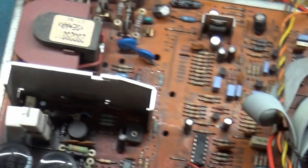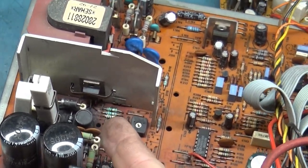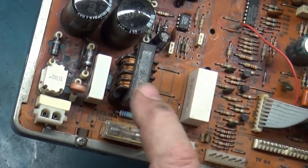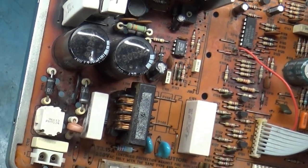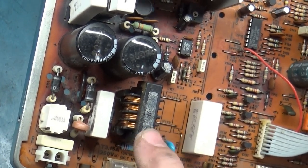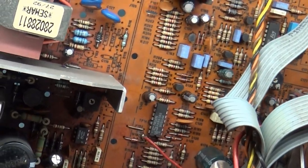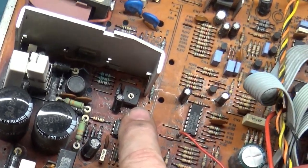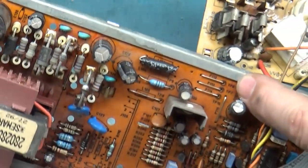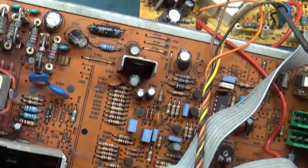And you got voltage regulators over here attached to this heat sink. This is your built-in isolation transformer. The Hantarex Polo does not require an external isolation transformer because it has one built in, and it's right there. So, yep. B-plus adjustments right here, and it needs to be set to 138, and you test it right here at TP6.